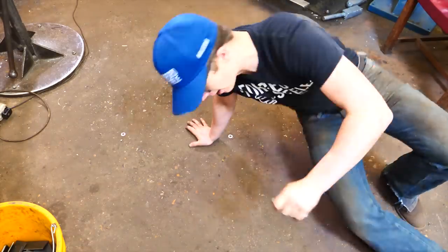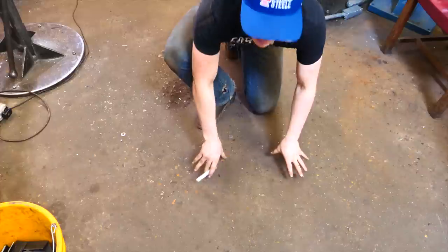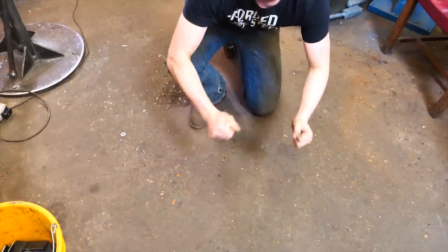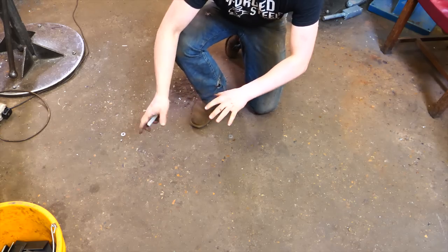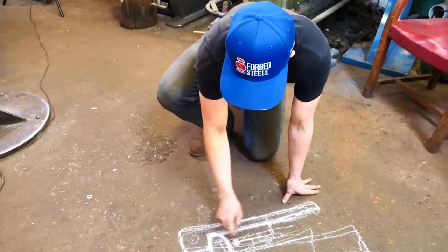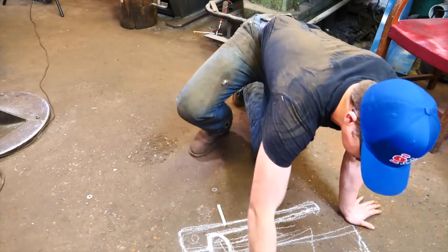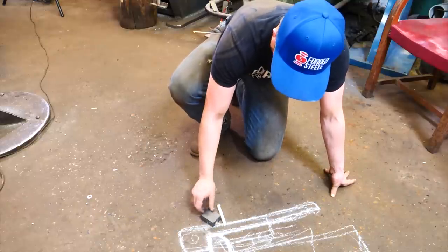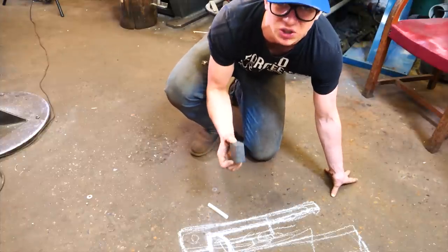I need to now have a think about how this is going to be forged. It is really important that I get this right because I have only four pieces of steel and I need to make four halves of a hinge. I've done a prototype video and made prototype hinges — I made them nice and big. I've had plenty of ability to learn from mistakes so I could anticipate not having those mistakes on this set. I need to make four of these as close to the same as possible, so I need to draw out all four to the same length, then measure off the exact same amount, isolating in the perfect place so they're all as close to symmetrical as possible.